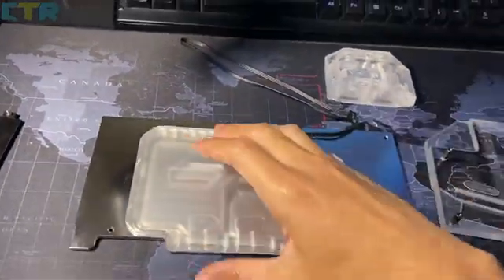As I mentioned in the previous video during the teardown, the backplate is actually for a 3090 Master. There are some differences in the capacitors — the capacitors for this one don't get cooled, but the 3090 has a different kind of capacitors and they are actually attached to the backplate as well. For the front side, it's attached to the block as well. So given that the capacitors are a bit different, I may have to put thicker thermal pads, maybe stack them together — I'm not sure. I'll just update you guys about that.